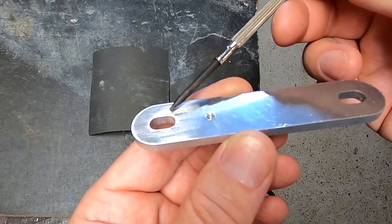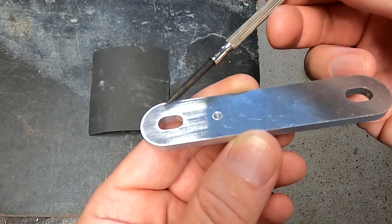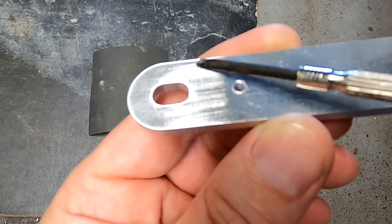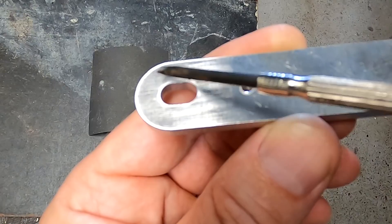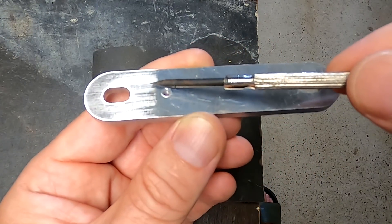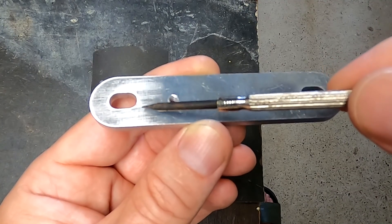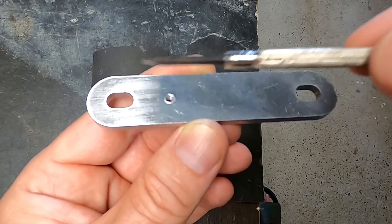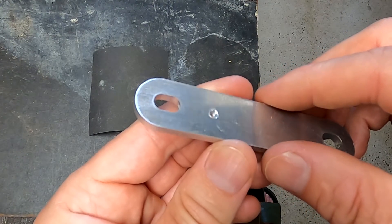You can see where the scratches are. Scratches are areas where the bus bar peaks out, and the darker color here are areas where the bus bar is lower. You can also see along the edge it's bright, and here darker, and here a bit brighter. You can see scratches there but not over here. So obviously the bus bar has contact here and along the edge but not in the middle. It looks like the bus bar is not 100% flat.